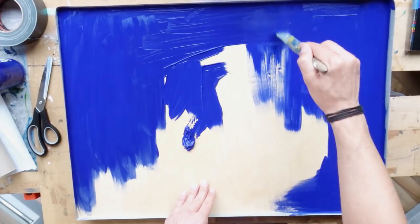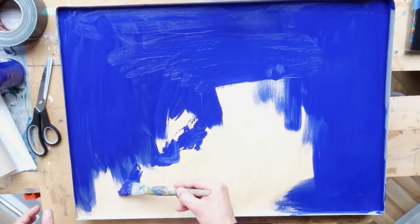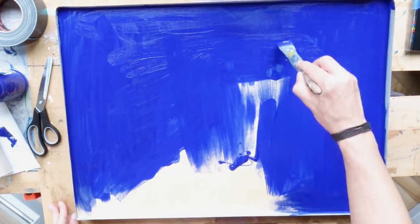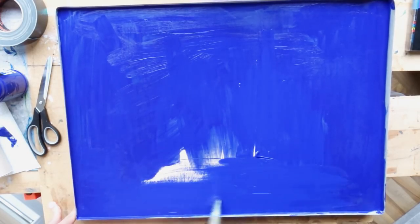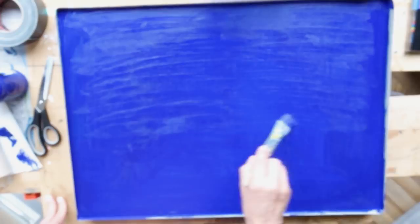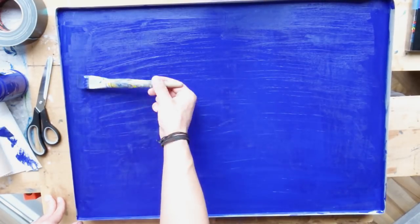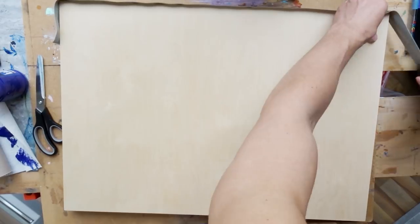As I like to have clean edges, I again decided to use my gaffer tape. We call it gaffer tape — it is some kind of really strong tape which has fabric woven into it. This tape really grabs perfectly to whatever surface, and if you put it really tight towards the wood, no resin is able to float through it. This is something I really wanted, because I needed a barrier for the resin to not flow over the edges.